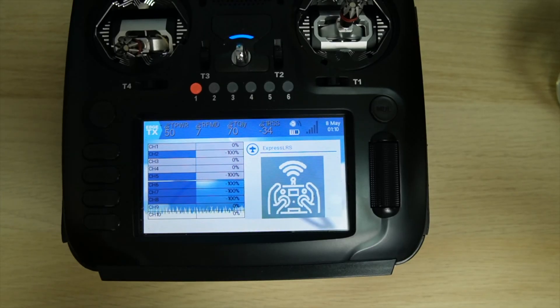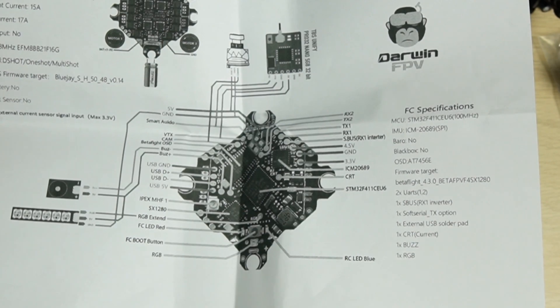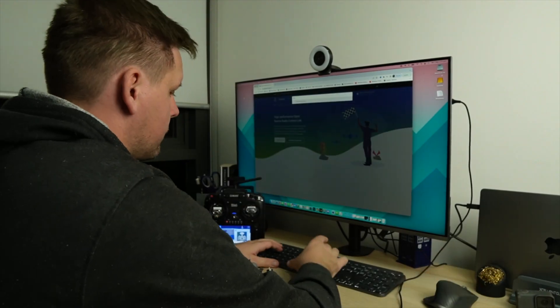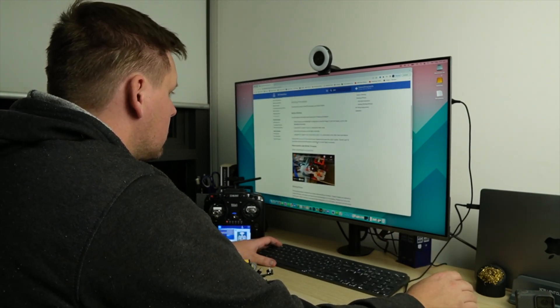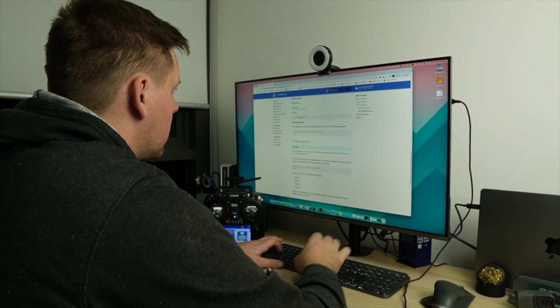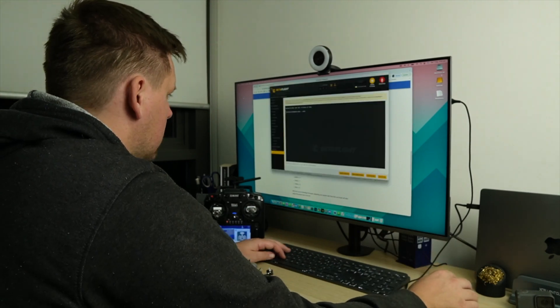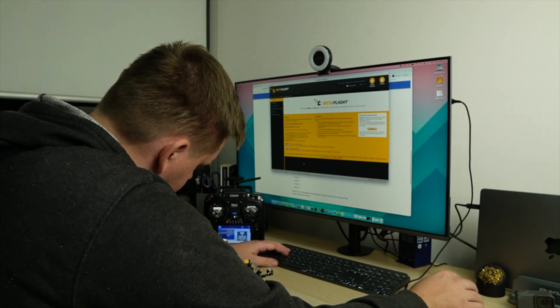The mounts for the Thumb aren't too far back on the frame and don't leave much room for the battery, so I had to relocate the XT30 battery lead to the side to fit the BetaFPV 2S 300mAh battery. The Tiny Ape uses an ExpressLRS receiver built into the all-in-one flight controller. To bind it, I went to the ExpressLRS website's SPI Receivers page, which translates your text binding phrase into a CLI command. After pasting the code into the CLI, typing save, and hitting enter, the flight controller reboots and binding is complete.